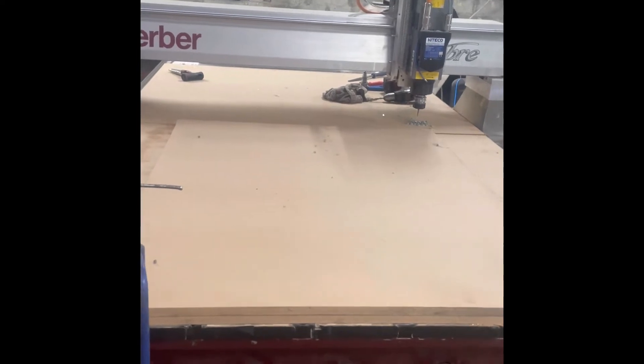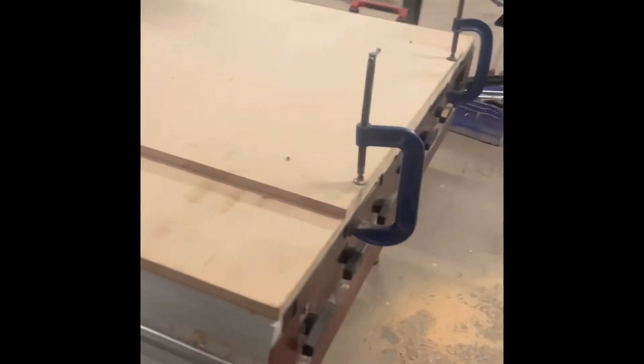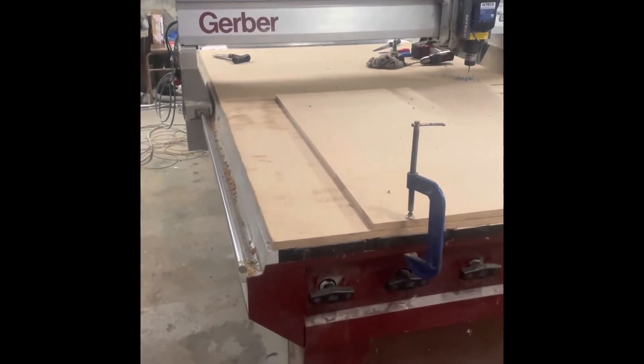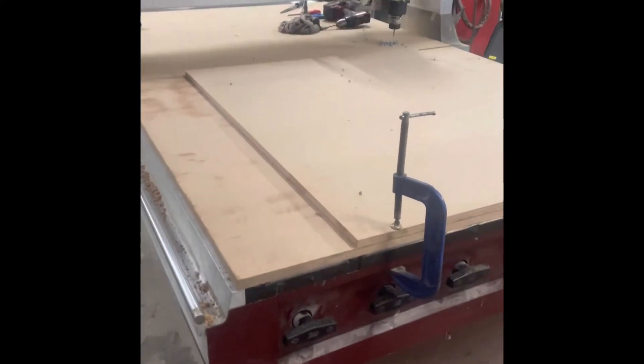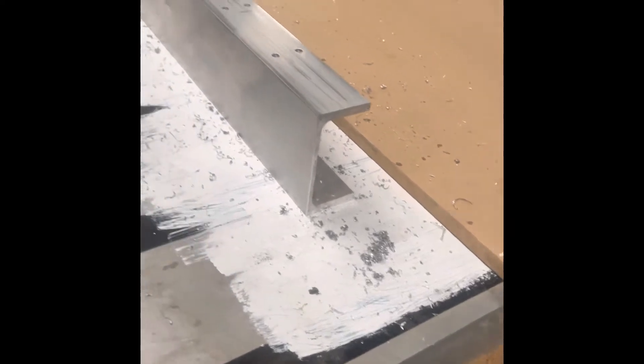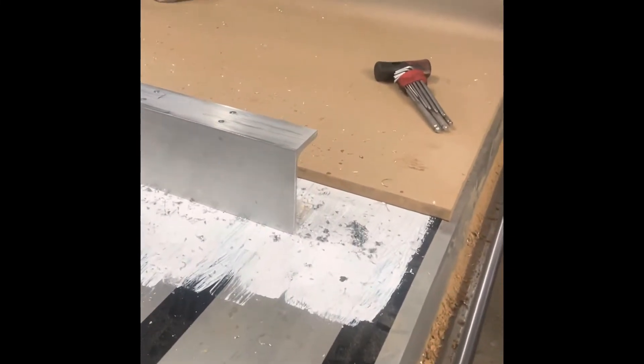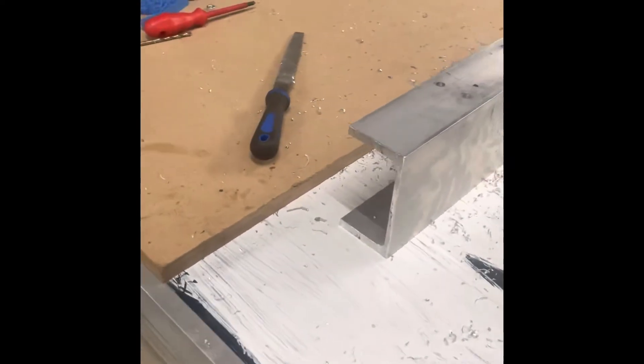What I did was add 4 pins by drilling 4 holes all in a square, then measured from one to the other to make sure the distance is the same — so the machine is square, meaning this axis is 90 degrees to this axis. We also added what's going to be the vacuum board underneath here. This is going to have grooves cut into it and on top of that there will be a spoil board. We also sealed up the old table — there were lots of holes along there, so we taped up the slots and sealed all the holes with multiple layers of paint.